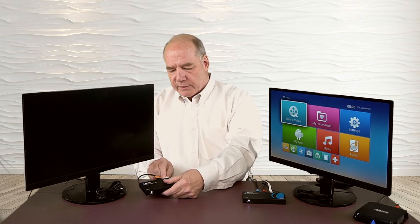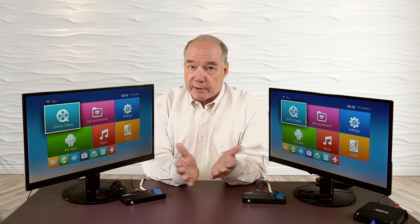I don't need to power the receiver up separately, but I do need to make a connection between the two units. On the back, that Cat5e and Cat6 connection is where you'll run the cable between them — nothing connects these two units except that cable. I'm going to simulate that with a short cable, but you can use up to a 150-meter-long cable, which is pretty impressive. Once I connect it to the transmitter and then to the receiver, the receiver will come on immediately. It'll go blank for a second to reconfigure, knowing it now has a partner. It'll come back on at the primary, and then come back on at the secondary — about a 15-second reset — and you're good to go.